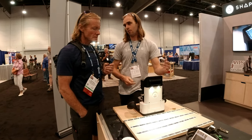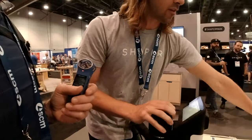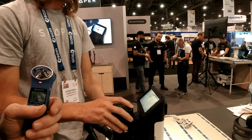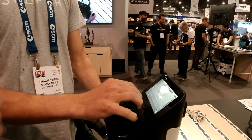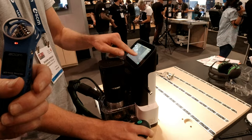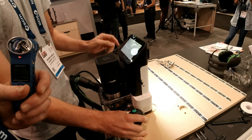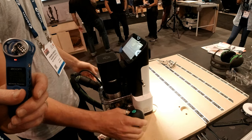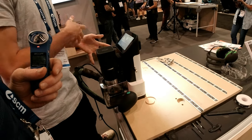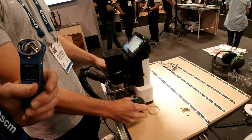I'll select this plum hinge file — it fits right here. It makes three cuts: one for the big spot and two for the smaller ones. I'll turn the grid on so it's snapping, and the file is already baked to the right distance from the edge. I move the anchor to the bottom so the file places at zero-zero. We already created a grid by touching here, here, and here, which builds a numerical grid so I can place things in a very accurate location.